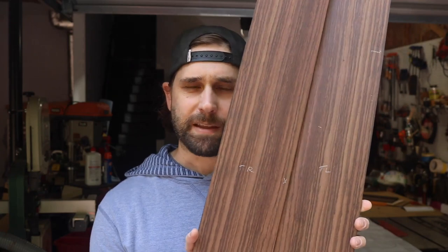I've got these book-matched sides - I think this is how they look matched, so I'll open them up like that. When I got them I was able to pick out sides that had the straightest grain I could find. I didn't want any grain runout on the edges because I want to avoid cracking while I'm trying to bend them.